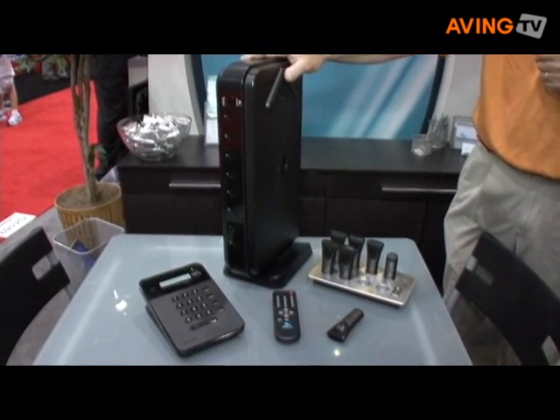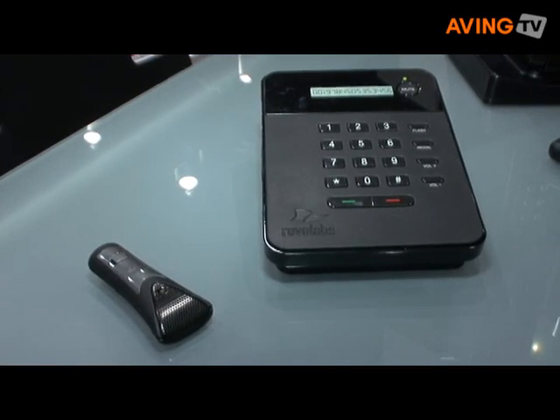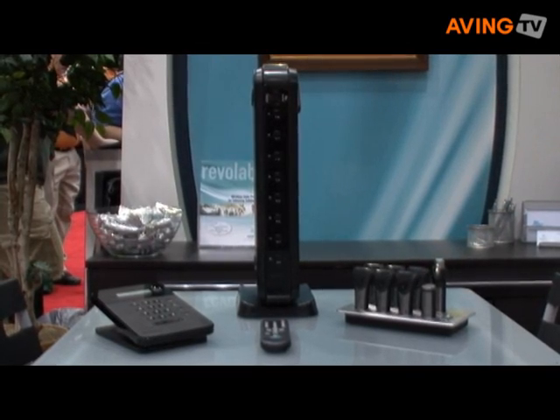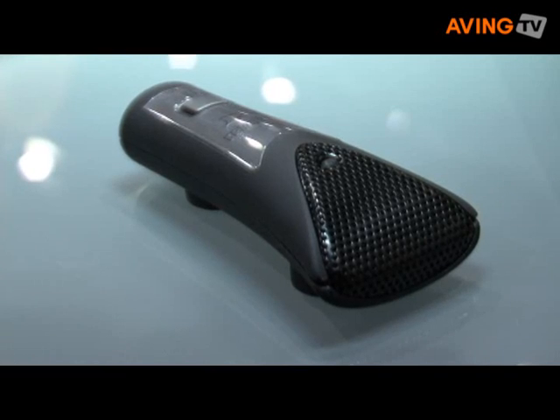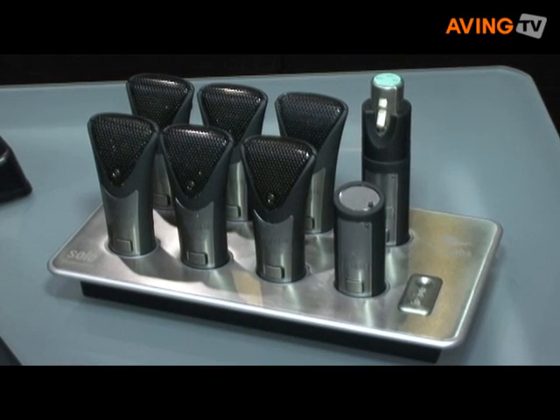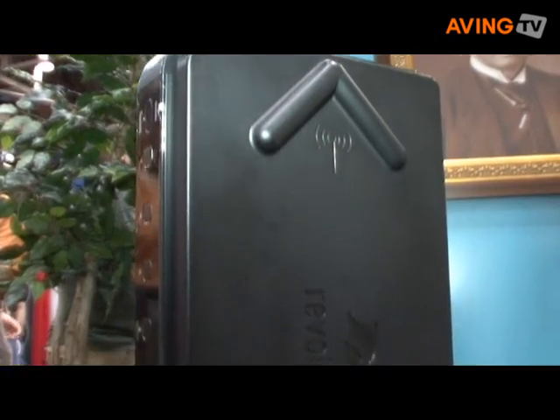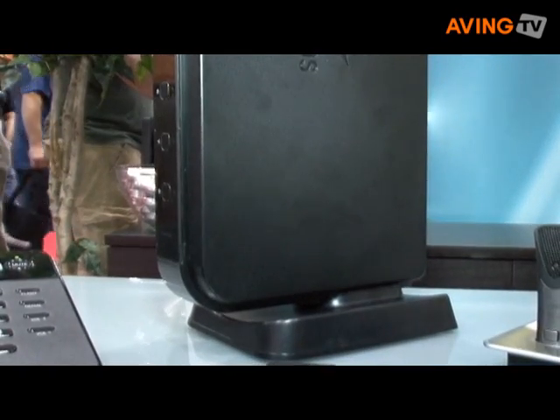Fusion is a turnkey plug-and-play wireless microphone system for conference rooms and business applications where we can actually do all of the audio processing within the box itself. Rather than just being a microphone system, it allows all of the echo cancellation, conference features, mixing, gating, controlling the microphones, providing EQ and noise removal within the same box rather than having to do it externally, as with our normal executive level products which require external processing.